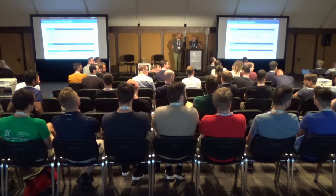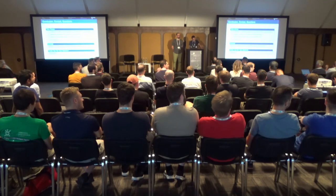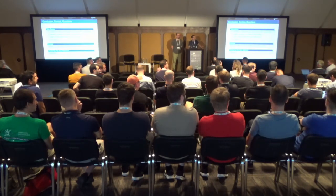Just one addition to the previous question: is this 35 micrometer copper layer sufficient for your demanded attenuation? Sorry, I didn't quite understand it acoustically. You said your colleague made an attenuation box from PCB board, and is it sufficient? Oh, good question. I don't know how much shielding he actually got out of it, but the way he did it, it might be, because it's really well connected, and he did very similar tests to what we did, these sensitivity tests. He did a variant where he also added interference, but I think if it's soldered well and you don't have any openings, it should be possible.